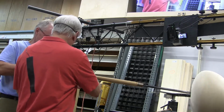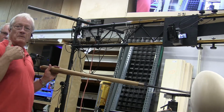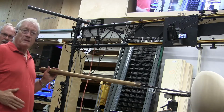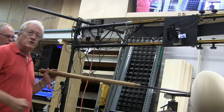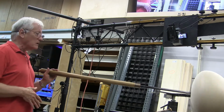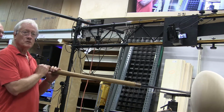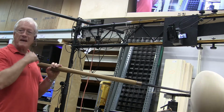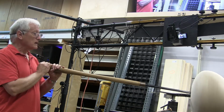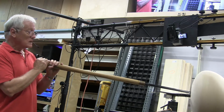So now, okay, let me make another point. I don't know how many of y'all do flat woodworking, but if you're planing a board or sawing and all this kind of stuff, you always do it down here, right? You work low. That's the power area. This is the control area. So you never do anything that requires a lot of power up here. And then finesse is right in front of you. But again, we're talking purely control, and we're not struggling with anything.